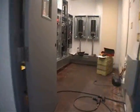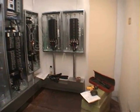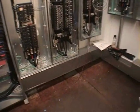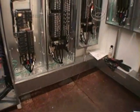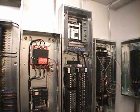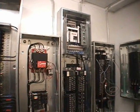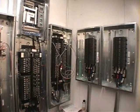This is our first Walgreens store we ever built. As you walk inside, you can see that the panels are already mounted on the wall of the room. You can see a wireway at the bottom that will have a skirt that goes all the way to the floor. You can see all the control elements are pre-wired and factory commissioned. We actually test for the foot candle thresholds as well as the temperature thresholds to operate the wall heaters and lighting systems.